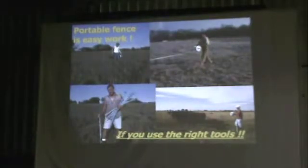With that black pipe above ground during the summertime, are you running into issues where the water's getting too hot and the cows aren't drinking as much? On black pipe run on the surface, does the water temperature get too hot for stock to drink it? When we were up at Lineus, we had a lot of these systems out and did some studies on water temperature at different times of the day and different lengths of pipe going to the tanks. We recorded water temperatures at 8 a.m., noon, 4 p.m., and 8 p.m. The 4 p.m. water temperature in the pipe was the only time the temperature got to the point that I would have been concerned about animal consumption.